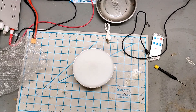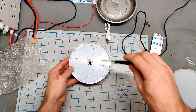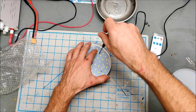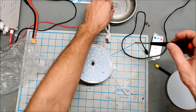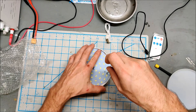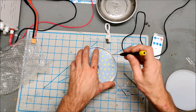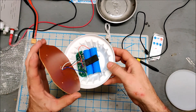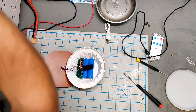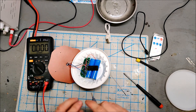I intend to upgrade these cheap Chinese 18650s with some quality ones - that's what we're going to do in this video. I was able to spudger this open - it came off super easy, no glue, which is nice. I see three or four little screws holding this LED panel on. Let's unscrew this and see what we have inside. There are the cheap 18650s - let's check the voltage and see why it doesn't turn on.